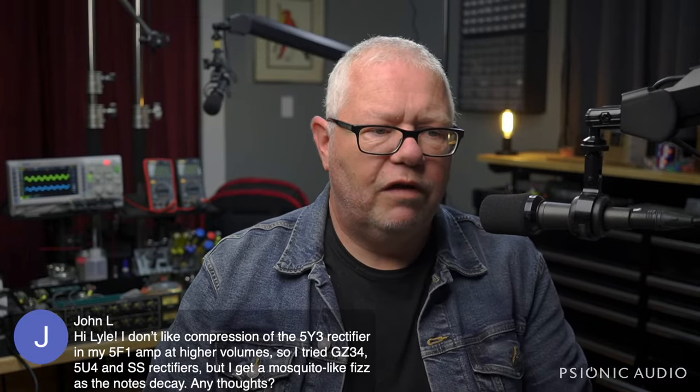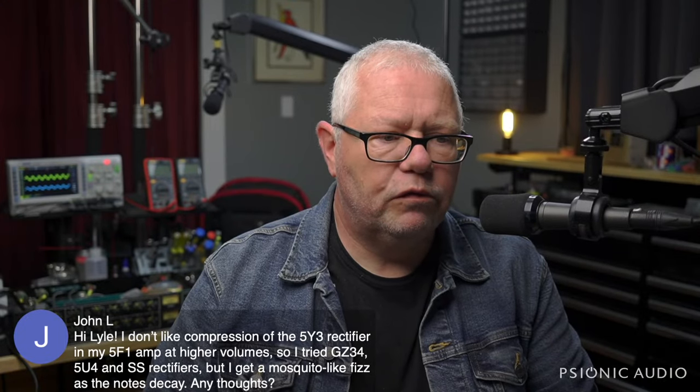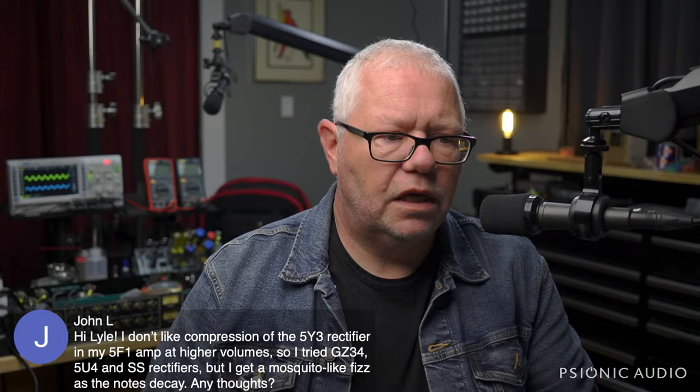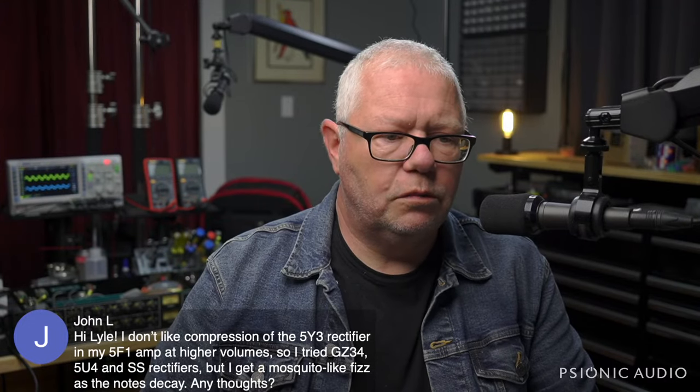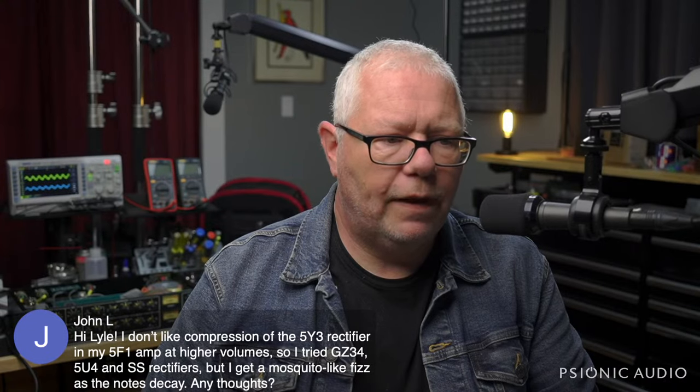He doesn't like the compression of the 5Y3 rectifier, higher volume, so he tried a GZ34, 5U4. Yeah, you're going to get mosquito-like fizz if the notes decay, because that's way too much. You're going to have a much, much higher B+ unless you also change the bias. A 5F1 amp is supposed to have compression.